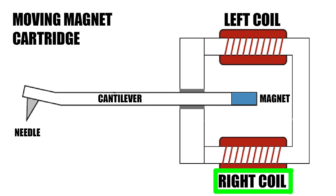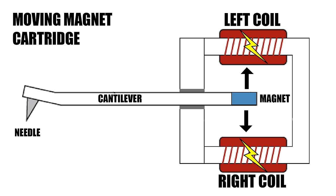Now that we're familiar with everything, let's get back to those vibrations I talked about. The grooves on the record create vibrations which start at the needle. The vibrations then move their way up the cantilever and finally make their way back to the magnet. When the vibrations push the magnet toward the left coil, a small electrical signal is sent to the left channel. Likewise, when the vibrations push the magnet toward the right coil, a small electrical signal is sent to the right channel. So basically, the magnet is constantly moving between the two coils, generating signals on both channels at the same time.